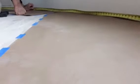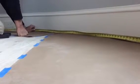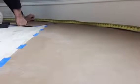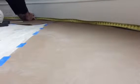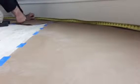We position the tape as flat against the wall and see the floor as much as we can. It's not designed to go that way, but we're going to get an awfully accurate measurement. Half of 192 is 96 inches, 8 foot. That's where we picked it again, and it seems to line up with our goal of 16.5 inches off the trim.